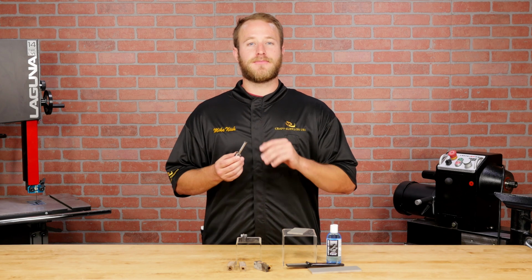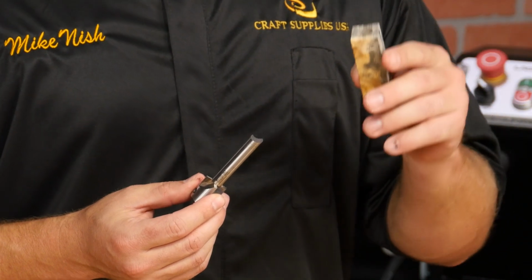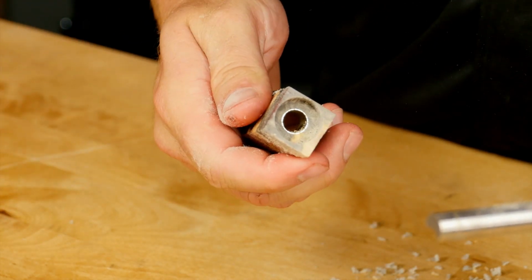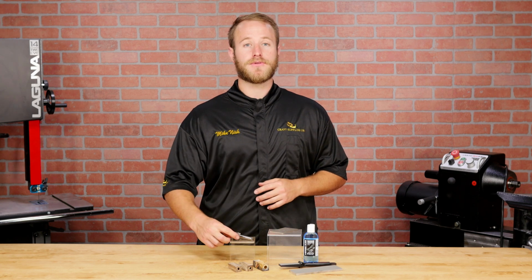A sharp barrel trimmer is the best tool for accurately squaring up pen and project blanks with the brass tube. It's an important step to ensure there aren't any unsightly gaps between the components in the blank. But with time, the trimmer head dulls. Let me show you what happens with a dull trimmer head.